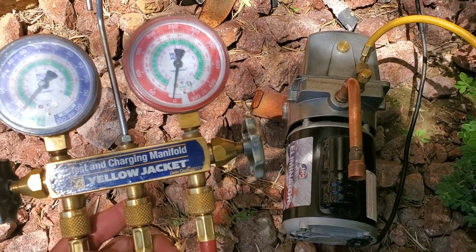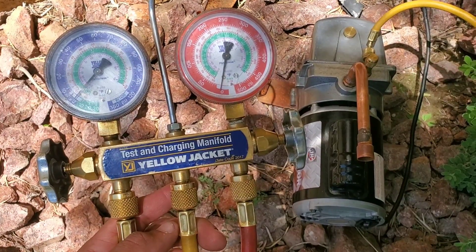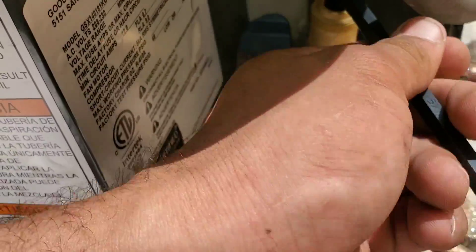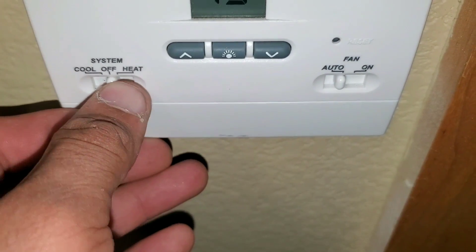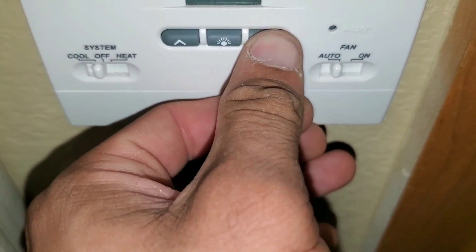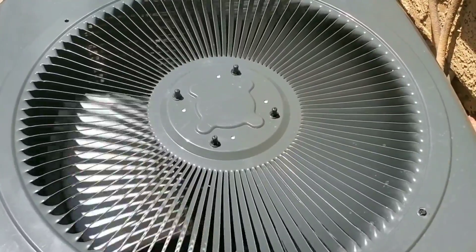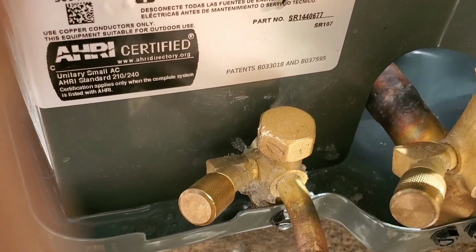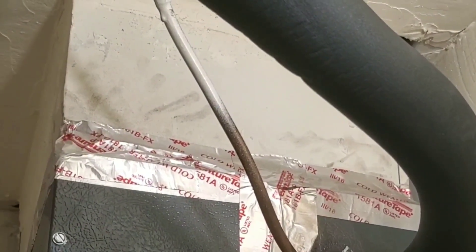Make sure that you pull a vacuum on the system. I do have a video posted on my channel on how to do a proper vacuum. Open your high and your low service valves. This condenser came factory charged with 410A refrigerant — we're releasing the refrigerant into our system. Turn on the breaker and all power supply, put in your disconnect, set your thermostat to cool and auto, and drop your set point below your ambient temperature. You may have to add refrigerant depending on whatever pressures you are trying to maintain. After charging your system to the proper pressures, make sure that you replace the plastic caps with brass caps. I would also suggest insulating your lines at the air handler as well as at the condensing unit.